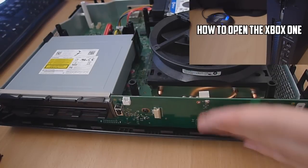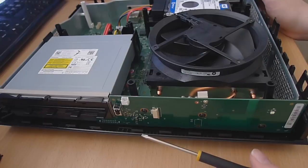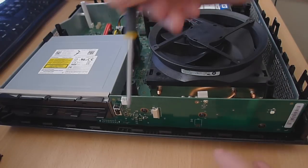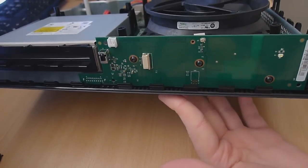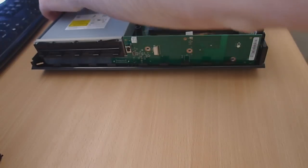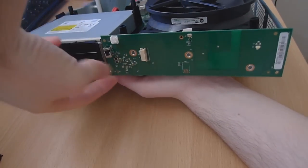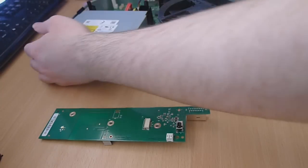What we're going to do is take out this RF board in the front where the LED is, so that we can solder on our new LED. You want to get a Torx screwdriver — a small enough flat head that can fit in and take the screws out would do as well, but you should really be using a Torx screwdriver. There are three screws here. I'm going to take those out and then we'll take the RF board out. You want to take the metal casing out of the plastic one sitting inside, then pull it out from this end where the plug is. And that's us — we've got our RF board out ready to work on.